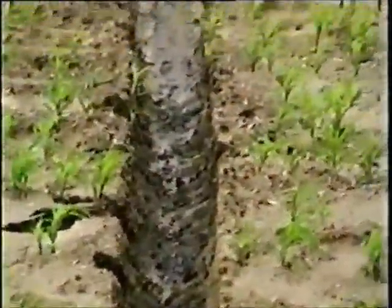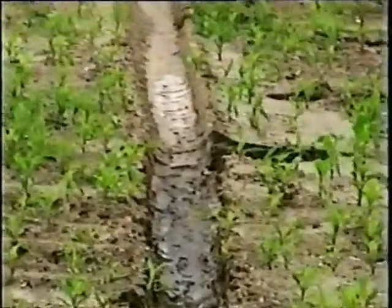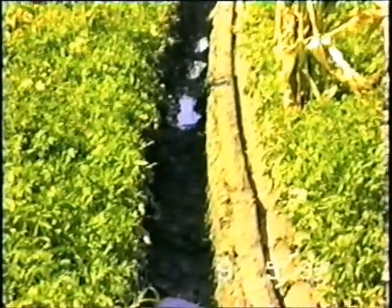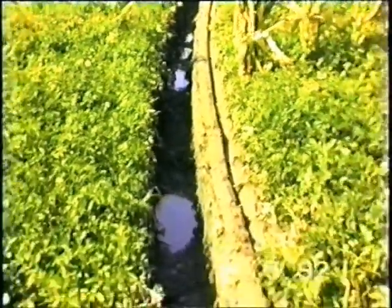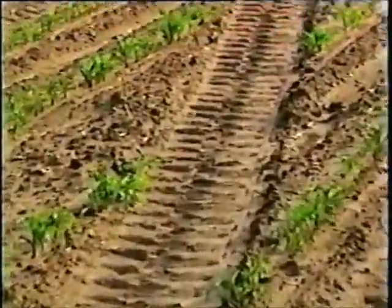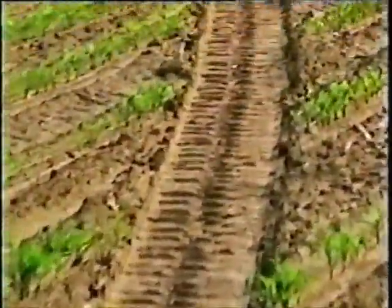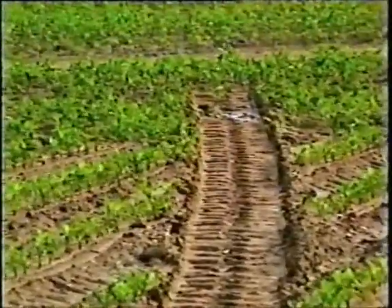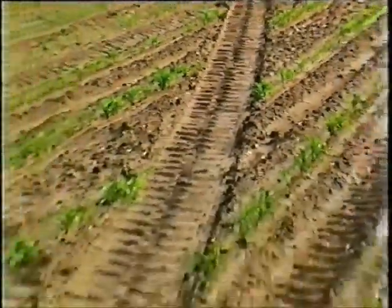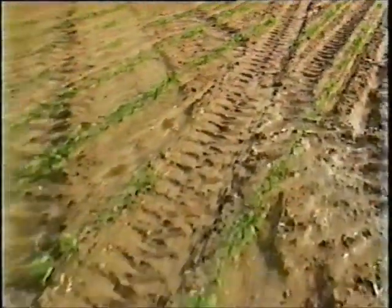If the circle is on a hillside, the erosion problem is compounded. Runoff water collects in the wheel track and erodes the soil as it rushes down the hill. Over time, this annual loss of topsoil damages both the topography and the productivity of the soil. The low soil pressure and flat surface of the Agritrack allows runoff water to be diverted from the wheel track, and with a little planning, even the most serious cases of wheel rut erosion can be completely prevented.